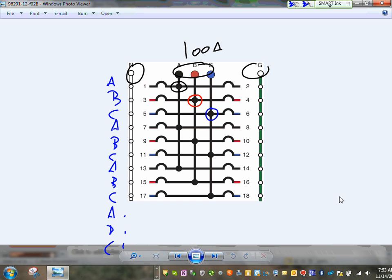It's so important, guys, to understand how the panels are made, because when you circuit, that's how you're going to be circuiting them. So if I have a machine that's three-phase, I can take phase one, two, and three. Circuit one, two. I have students, guys, that wrote on a three-phase multi-wire circuit, circuit one, two, and three. If you take one, two is the same hot, and three, you're taking only two phases, basically. That's not three-phase.